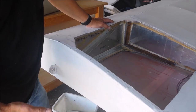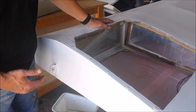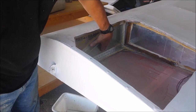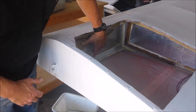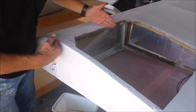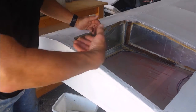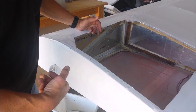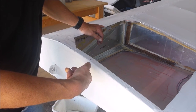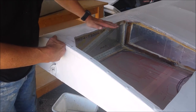The maximum bending moment is at the wing strut. The shear is maximum at the strut. There's a doubler in the web out there. There is some shear stress here that's trying to move it up and down. And then there's a normal force. There's compression in the spar from the fact the wing strut's under tension when the aircraft is flying in a positive G. The wing strut is in tension. That means there has to be a compression here on this to counteract that.